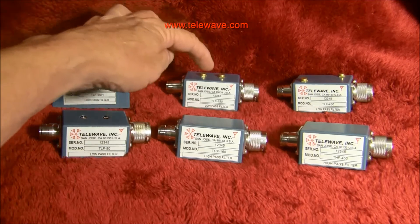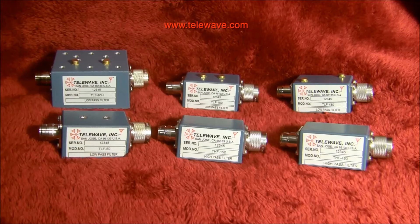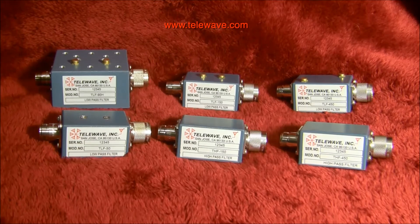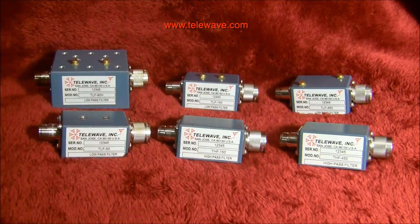The center one is a low-pass TLF 150, for the 150 MHz range, covering maybe 140 to 175 MHz, and then rolls off by 345 MHz by at least 40 dB, typically probably 50. Then we have a TLF 450, which covers 430 MHz to maybe 512 thereabouts, and rolls off for upper frequencies above that — at twice the frequency it should be at least 40 dB down.